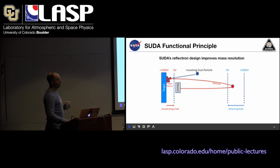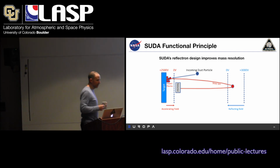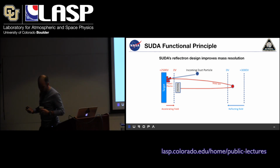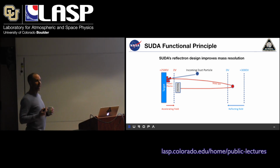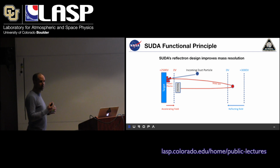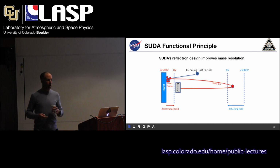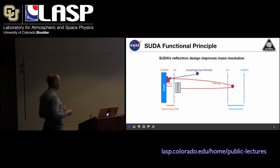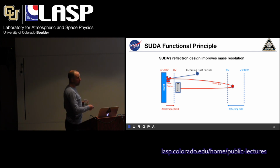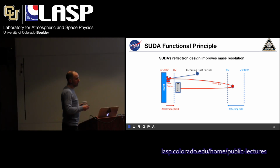What's the target made out of? Good question. It's coated in iridium, and it's made of titanium. And we chose iridium because it's very inert, super hard, and it has a really high melting temperature. And so this is all great for this kind of science because, let's say we had something soft back here like aluminum, what we would see in our spectrum is stuff from the particle as well as aluminum, or any of the impurities that are in aluminum, or if it's aluminum alloy, the minor constituents in that alloy. So we put as pure as we can get. It's, I think, 4/9 pure iridium, and we put it on titanium.